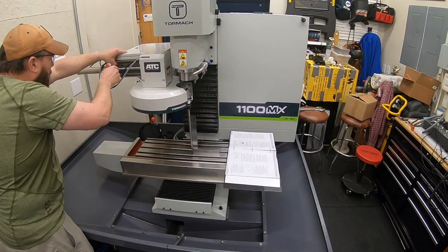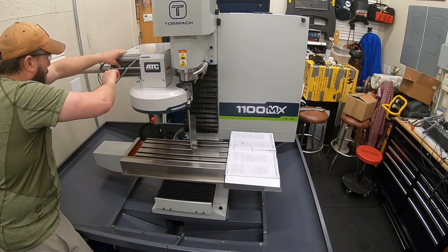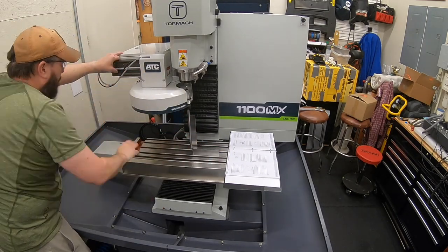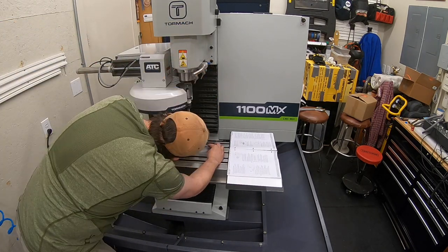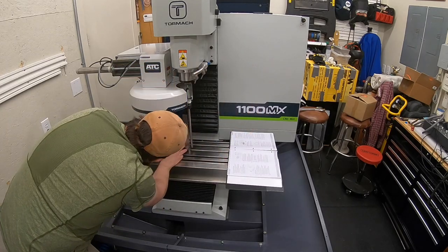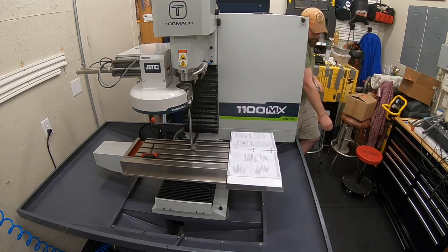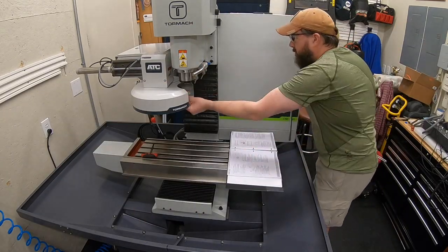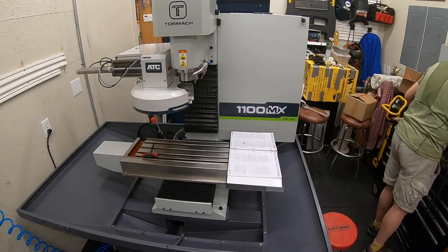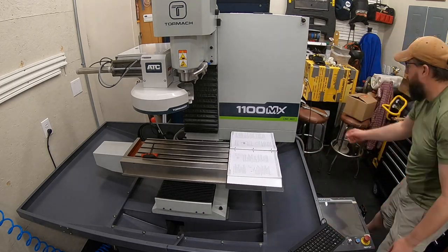The video on the install on this is really good. These steps right here where you are squaring up the x-axis and then squaring it up to the y-axis, all that I felt really good about, felt smooth. It wasn't until I got to trying to line the spindle up on the tool tray. The instructions say you're looking for an equal gap all around. I took that literally of kind of left, right, and that amount of gap I tried putting on the back of the tool changer as well. And it turned out that the tool changer just about needed to touch.